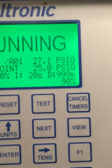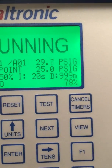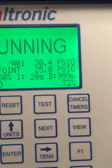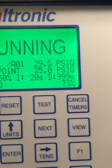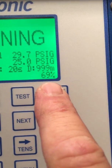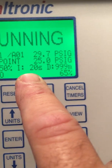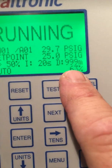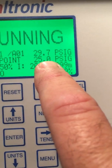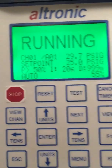But it's still very, very sluggish. If this was the real world, the pressure keeps going — if the valve can't close, we could have a problem. The longer I leave it here, the faster this number will start coming in because of integral. Integral is kind of the past — I need to be closed because I have 29.7 pounds but only a 25-pound target, and I'm not there. The pressure keeps climbing.